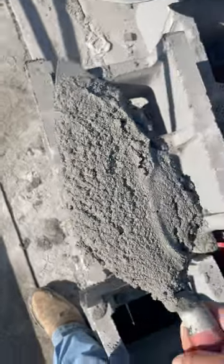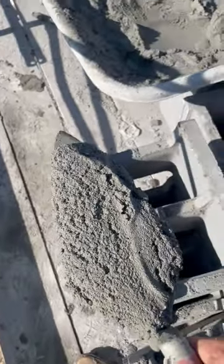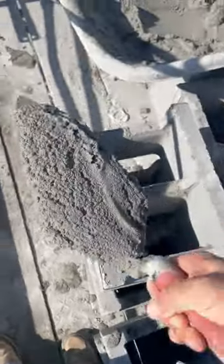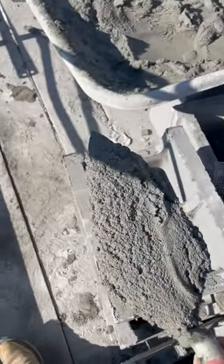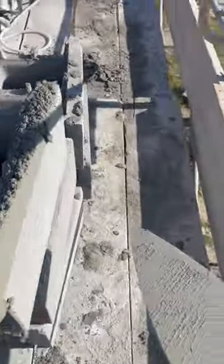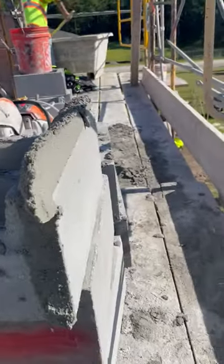This time, whenever you spread, you're going to put it on straight. And instead of keeping your trowel at an angle, you want your trowel as vertical as possible. So whenever your mortar is not angled back, you're going to get a bunch of holes in your bed joint. So you're going to start at the end of the block and spread your bed joint. See how straight that stands up and see how full it is.